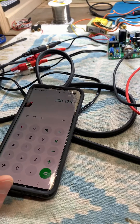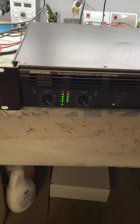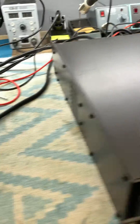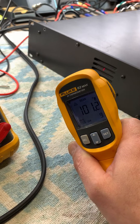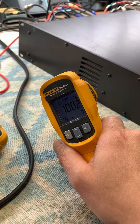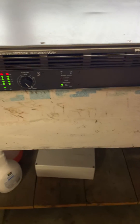That's 300 watts into each channel. And the thing is just sitting there, pegged into an 8-ohm load, and it just doesn't care. It's very interesting how these things are actually decently robust. It's generating some heat, but it's probably less than 100 degrees — 101 degrees on the output. Both channels fully loaded into 8 ohms, it doesn't really seem to care.